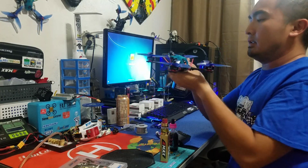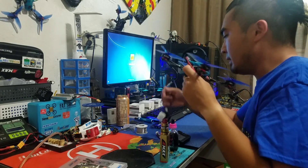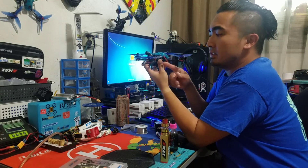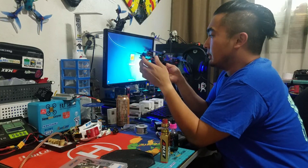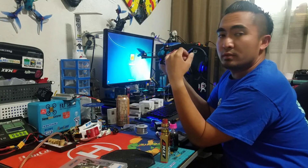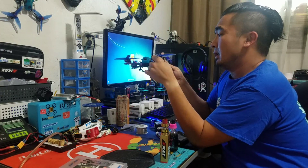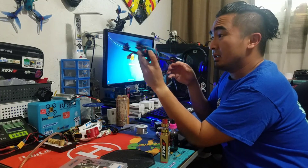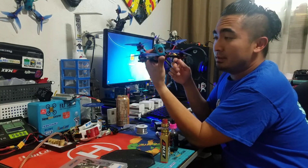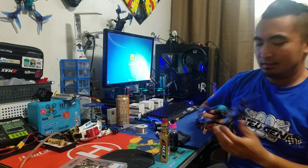Check this out — I wanted to show you guys. If you do run a canopy, it does light up the canopy really well, and if you have the LED facing rearward, that would be a nice chase LED. This stack all around was super easy to set up. Aside from soldering the motor wires, receiver wires, and camera harness, and then configuring it through Betaflight, it was really easy to set up. I love stacks like this, and with the specs on this thing, hopefully other manufacturers follow suit. I think this might be a secret weapon. So until next time, thanks for watching, and hopefully you'll see me kick butt with this guy.